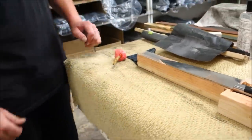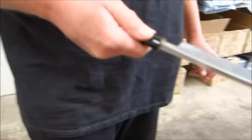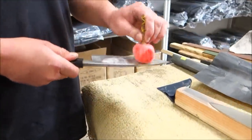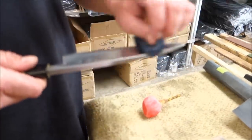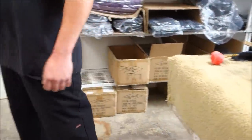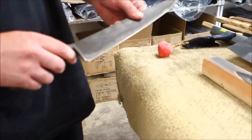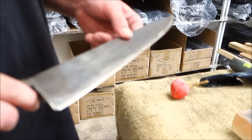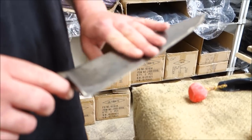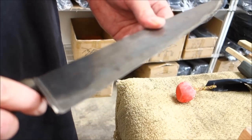The Shun polishing kit is also really good for non-stain-resistant knives. You can use a scouring compound like Bar Keepers Friend and physically abrade the surface to remove rust. However, rust is actually its own worst enemy — let the knife patina a little bit and leave it. If you constantly try to remove the patina it will just come back when you cut anything acidic. But you can also force patinas if people want a special look on a non-stain-resistant knife — we can do that too.